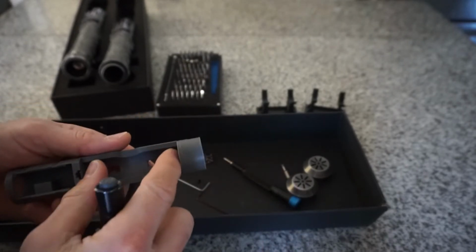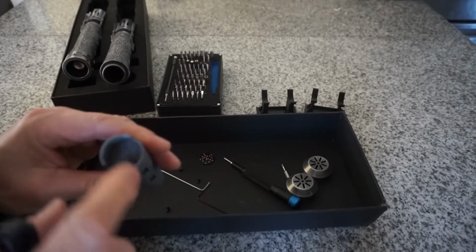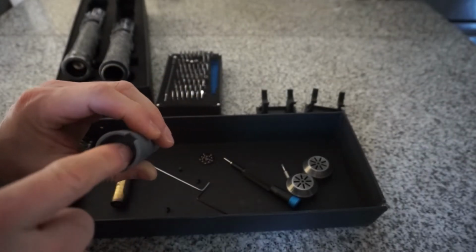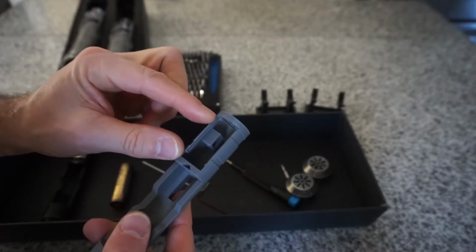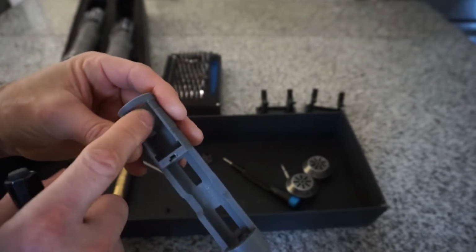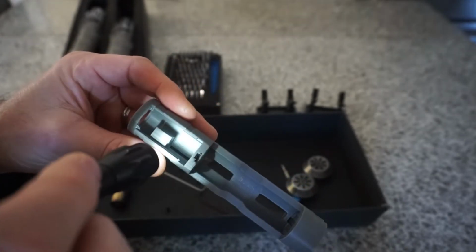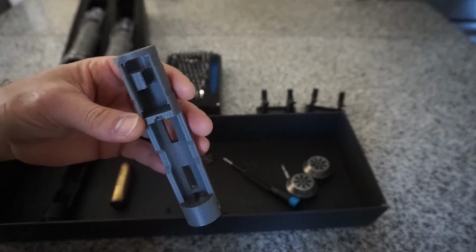So the battery is installed with your wires, your terminals are installed. Next I'll do the speaker, so 28 mil, right? If you use the left side for power, use the right side for your speaker wire. Get that installed, run your wires up, again just enough slack so that you can solder to the bottom of your soundboard, the Proffie board. But you have a lot of space, right? There's a lot of space in here to hide wires, so you don't have to go crazy with wire management.